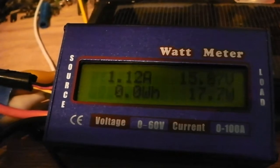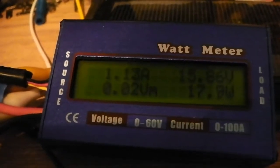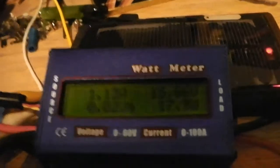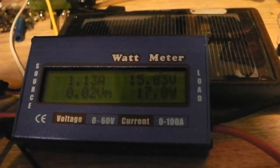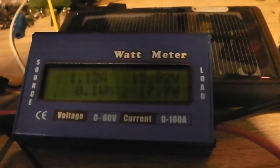I'm just going to turn one set of lights on - drawing one amp. I just want to see how many milliamps or watt hours I draw out of this battery before it goes flat. I'm using the auxiliary power because these are lithium cells and they are protected, so when they go flat the power stops coming from the battery pack and all the data on the meter will disappear. So we just have to wait and see.